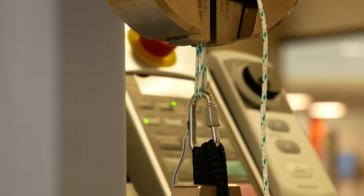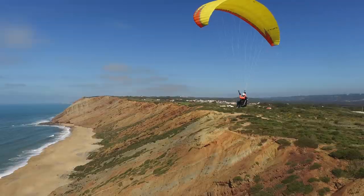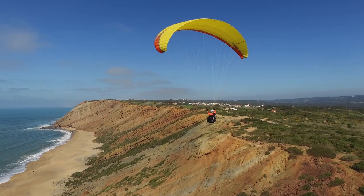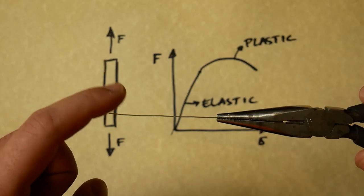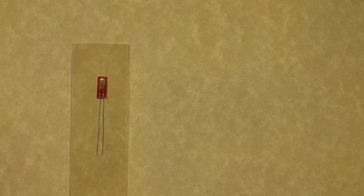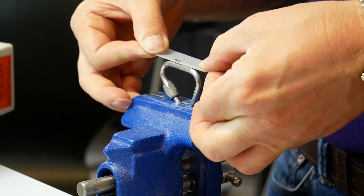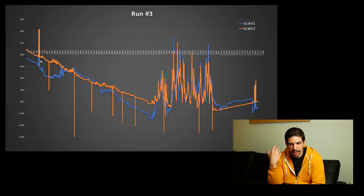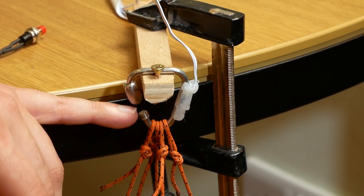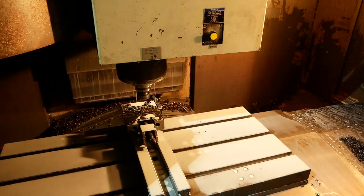With that I started with sensors, and being able to measure line tension in flight was my objective. I went back to school to learn about forces and sensors that can measure those forces, and decided to use strain gauges on the maillons themselves to measure line tension. The maillons worked okay, but only when the gate was open, so that was a compromise I wasn't willing to make.